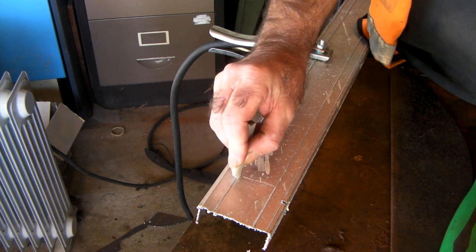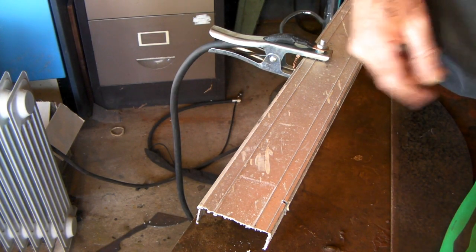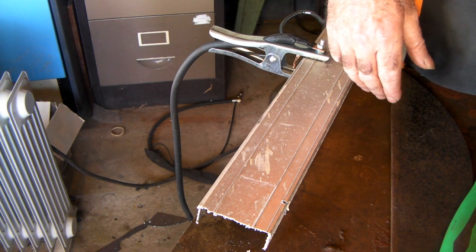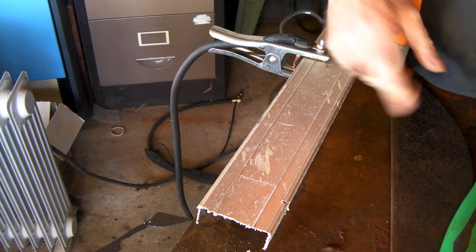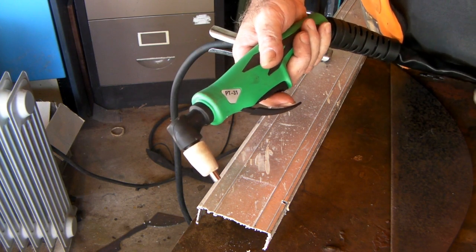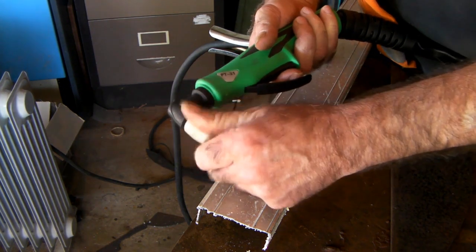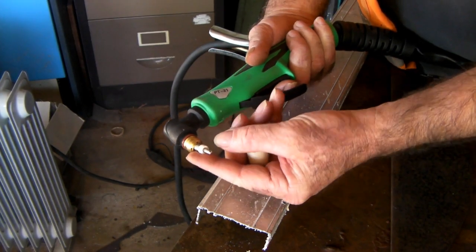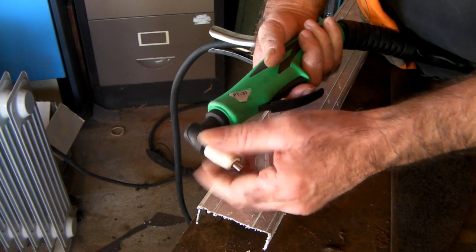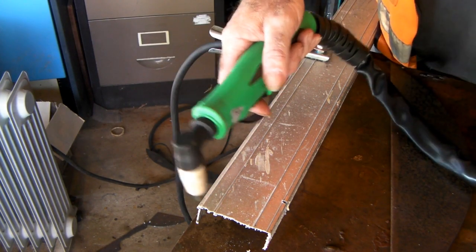This is 3mm aluminum - I don't know what that is in imperial measurement, you guys will figure it out. Remember, this is with my 40 amp plasma cutter. If I was to buy another one I'd buy a Cut 50 because it gives you that extra 10 amps of grunt. I'm using my standard PT-31 plasma torch, and I'm using nickel plated consumables - nickel plated tips and electrodes. I find they're a little bit harder and they cost the same, and I've just had better results with them. I'll put some links in the description.